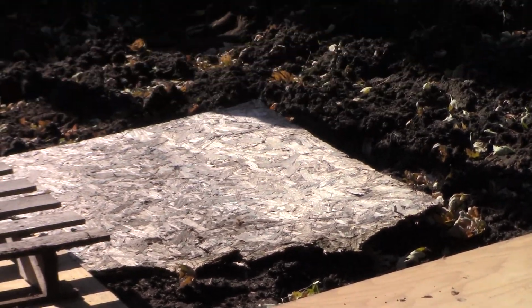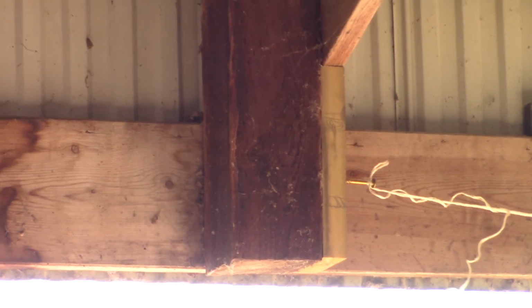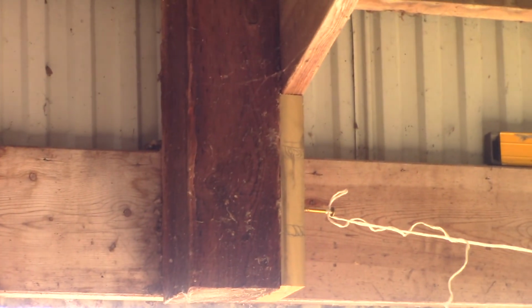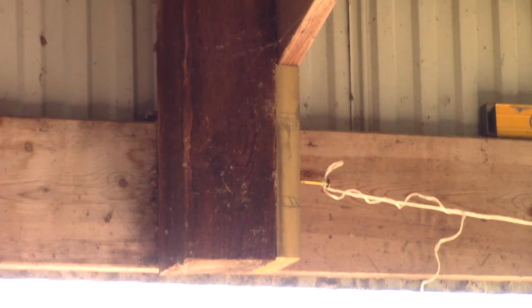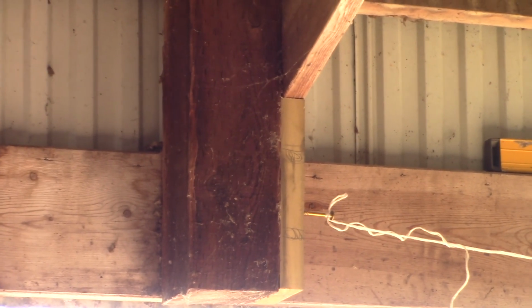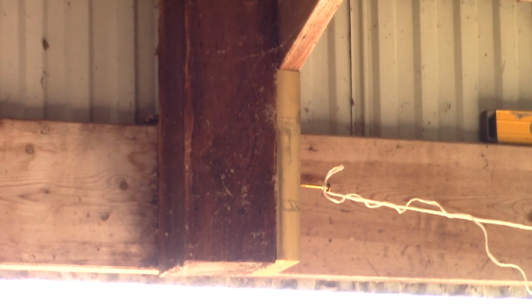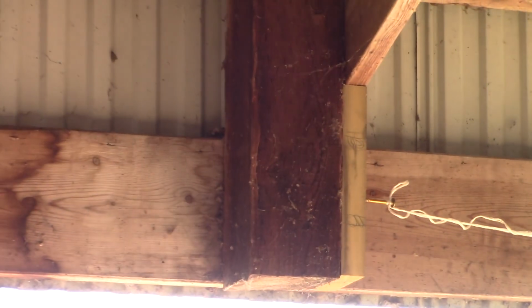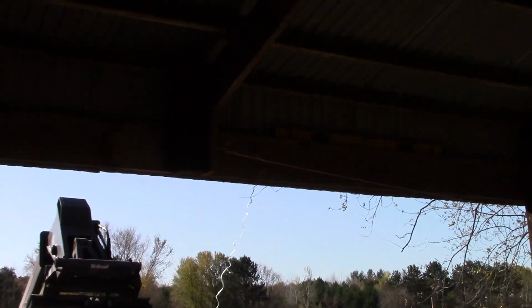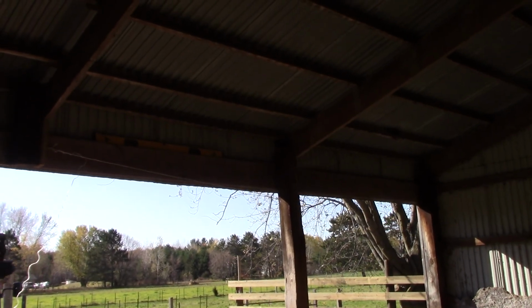And back at the top, obviously when we put the post in, once it's cured, we're going to take 18-inch 5/8 double dip galvanized all thread, or threaded rod, and we're going to sister that together, basically in a sandwich mode. And that will serve essentially as the new column support. I don't know if it will be yet this fall, or possibly next spring after the thaw.